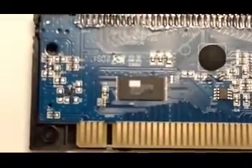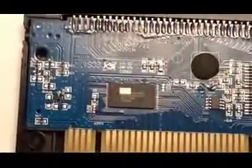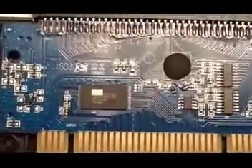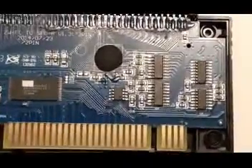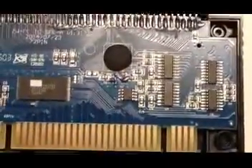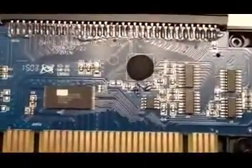So I'm back. This part over here turns out its part number is 29LV004BTC-70. Now, usually when you hear something like a dash-70, that does hint that it's a memory. So this first step was to record these part numbers and then look them up. Here you see a cluster of four chips, probably SOICs. The first two on the left both appear identical and their part number is 74HC597. Then the top right-hand chip — that's the LS138 — and I'm going to verify if that's a decoder. And below that is 74HC74. So I will look those up.